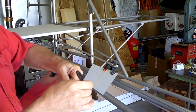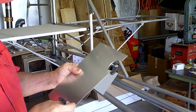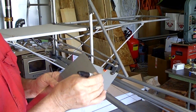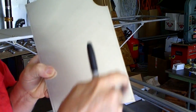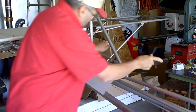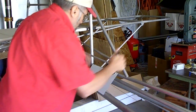So I'll just go down the four edges here — again, a quarter of an inch in and mark this line. I think my Sanford Sharpie is getting a little bit old; it's not wanting to mark too well. I do have my edge-distance lines made, and I will now be able to place this on the fuselage. This one goes on this side, and I'll start marking where I'm going to rivet this piece on.